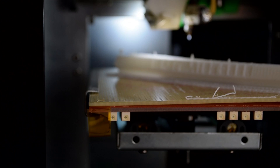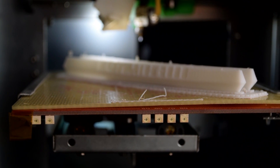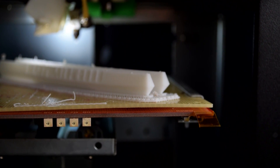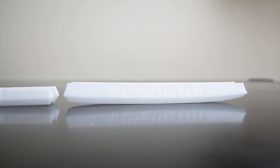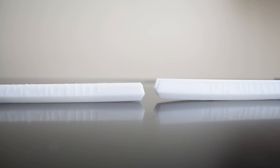And — failure, sort of. I ran out of filament. But how did the print turn out? You can clearly see that the raft stayed firmly stuck to the bed, which is a win. However, if you're ever in doubt of the forces involved in warping, check out the lifting of the plate from the heat bed — it actually bent the plate up with the print, which is pretty insane. Comparing how much flatter this print is compared to the previous one — it's tons better. Not perfect, but pretty amazing what a difference of 30 degrees makes. Plus, having visual feedback meant I could wait till I knew the bed was at stable temperature, instead of just putting your hand on it and guessing, which is useless.